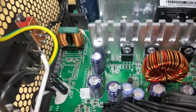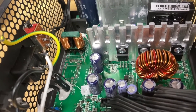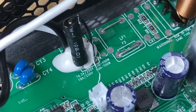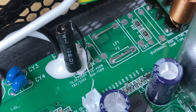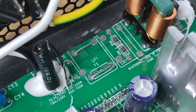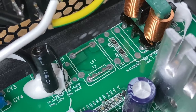You can see where they've ground off the paint underneath the standoffs which are basically just stamped into the steel chassis. The ground plane on the circuit board is actually connected to the chassis, so if there was a fault on the circuit board it should trip or blow the fuse. It's good to see that there is actually a fuse in here. There is an unpopulated section - I'm sure there was some interference suppression that was going on but they've opted not to use that for cost cutting.